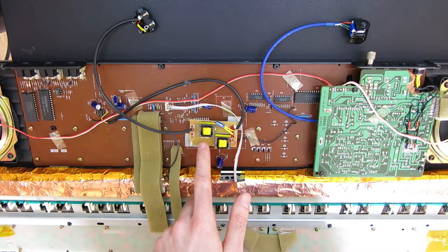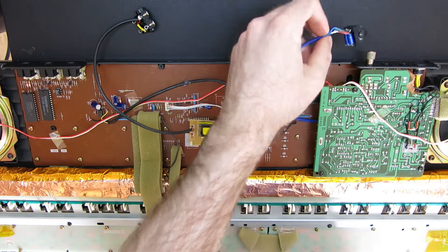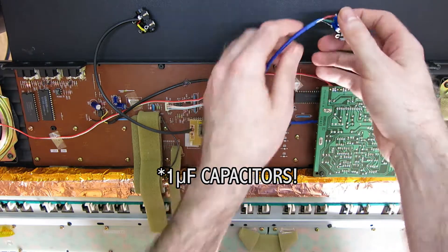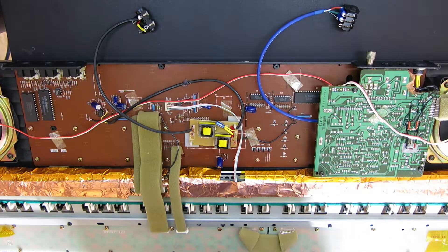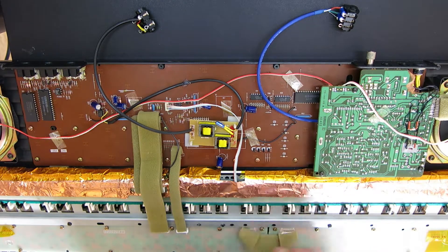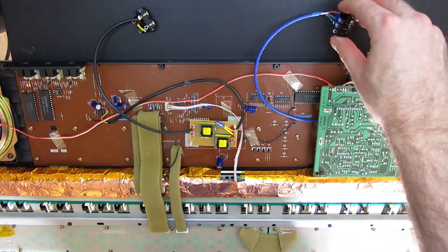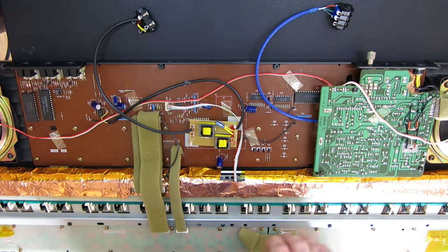I tried a second transformer and tried moving that around, but that actually made the hissing noise worse. So apart from a couple of 1UF capacitors just on the back of this, this is directly tapped for the moment. You may remember from the previous video I mentioned a giant piece of foil coated in sticky-back plastic with an exposed end and a crocodile clip as a shielding plate to move around. What I hadn't tried before was actually wrapping it over the keyboard. It seems the tape-rewinding noise coming from the drum side was coming not necessarily from the LEDs but from the keyboard scanning matrix, because putting a piece over this side and wrapping it around really dropped that noise down.